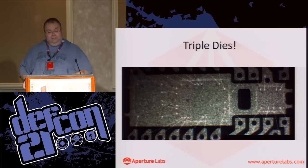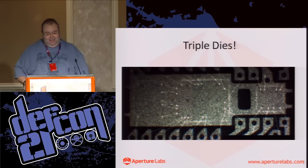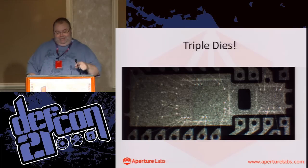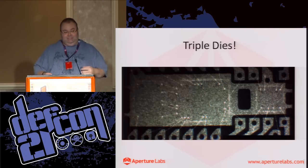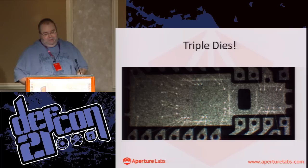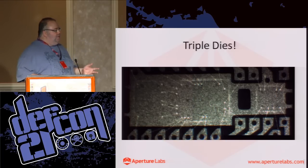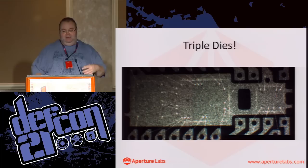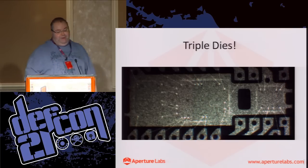And it turns out that is a radio chip, which we weren't expecting in this particular device. And as it turns out, it's there legitimately. But it could be completely illegitimate. There are issues with supply lines being compromised, fabs churning out dies that have modifications. And here, there's a small RF device that could be embedded in the die itself.